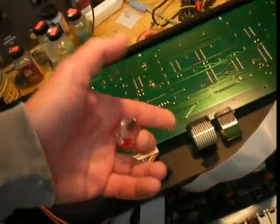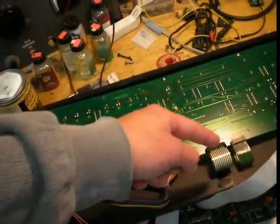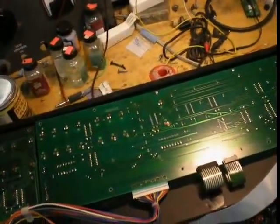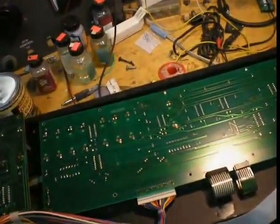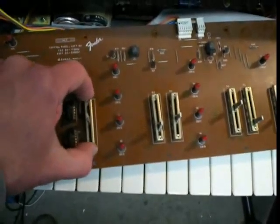I didn't do these when they were bent. I got them out of the connectors carefully, and actually I trimmed this one just a hair because the end of it was starting to fracture, and I figured, well, I'll just get that all cleared up there. But down here are the other ones that come out, and we tightened up all these potentiometers. Often if they get hit, they'll stress, and I just removed them and tightened up the clamps on all of them on the outside there. Now I've got a little spacer under this one, because it wanted to go that way, and I'm just trying to minimize the stress on it, and I think that's about the best configuration right there.